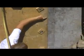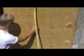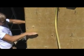There's a raceway or keyway in this wall right here on the inside. We pour our section in here. We have to put the whaler bars through these X-series snap ties. The wall will expand and that's where it will stop.